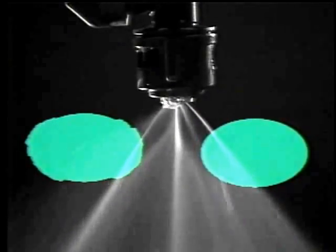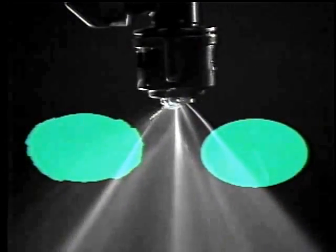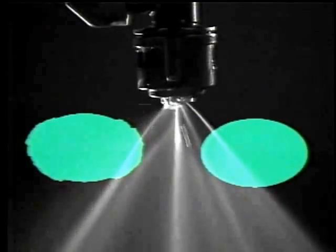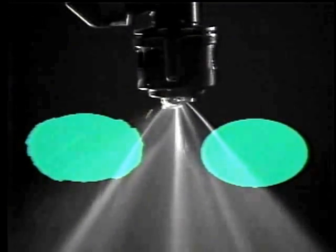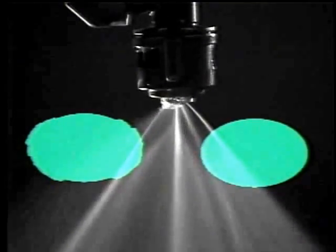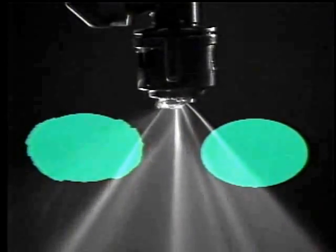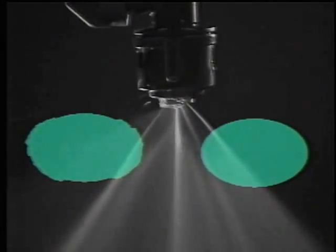As a general rule of thumb, if a nozzle's worn more than 10%, it should be replaced. That's what the manufacturer says, and you need to replace them on a regular, every year basis. Well, the nozzle output's in the booklet, right? Right, John. Well, we got these nozzles squared away. Let's go on to something else.